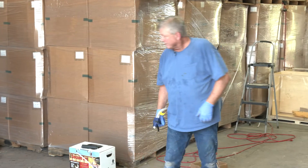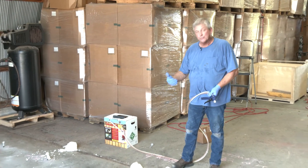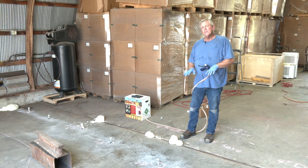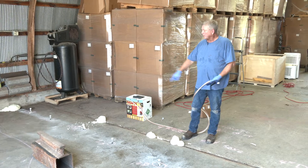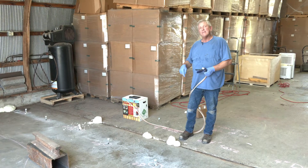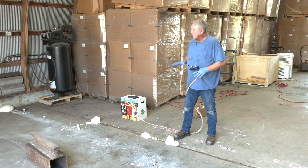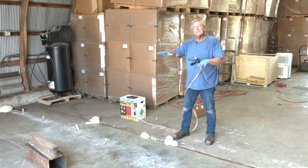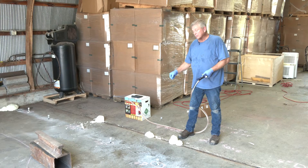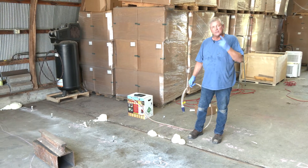As you can see, we have been able to fill the cavity underneath this dropped portion of the concrete floor. We know the foam has moved to all the points of least resistance. Now we go back, pull these little ports, and re-drill them so we have fresh access to the port holes again. When we start the second round we're going to push foam past those areas already solidified — this is what will really pressurize and find every little nook and cranny underneath the slab. That's our next phase.